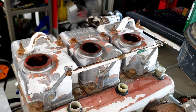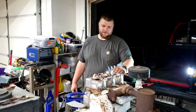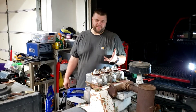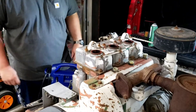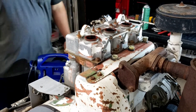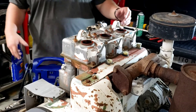I'll actually make a quick video showing you that in action. So with the decompression on — the exhaust valves held slightly open — I'll crank it over. It's going to crank a lot faster but will not fire because it doesn't have the compression to ignite the diesel. Then I'll move that lever back and listen for the difference in engine speed. And that's how this decompression system works. See you on the next one.